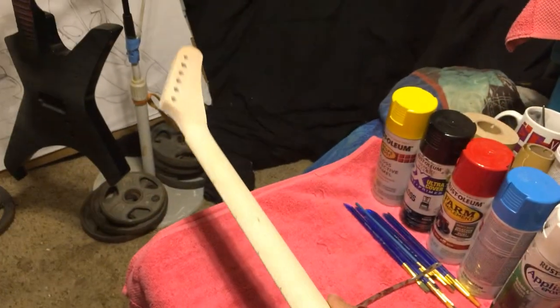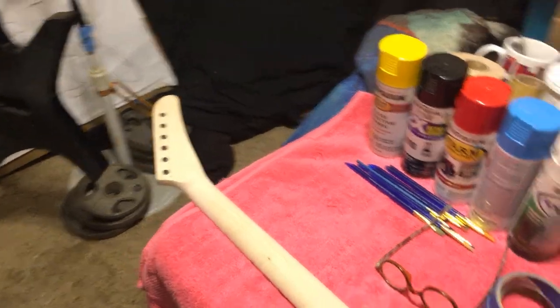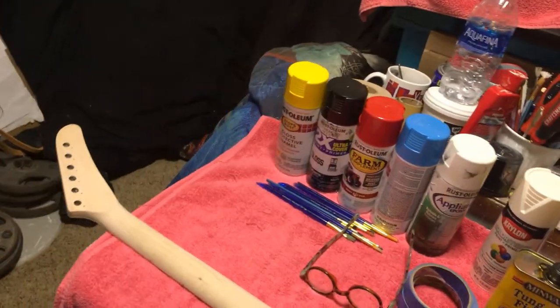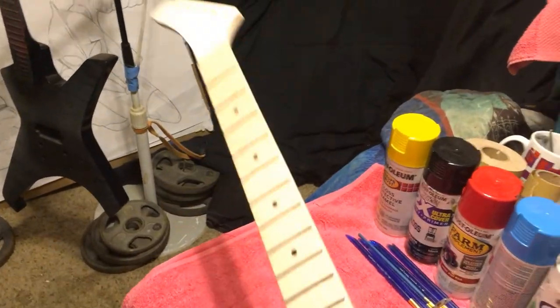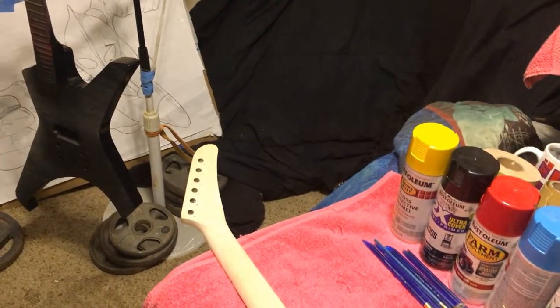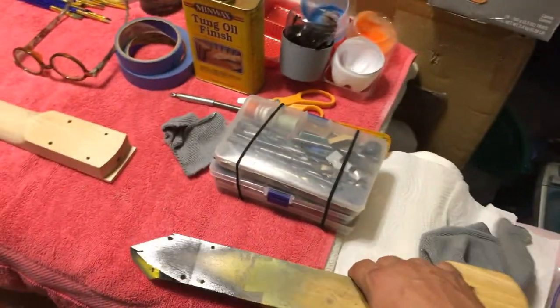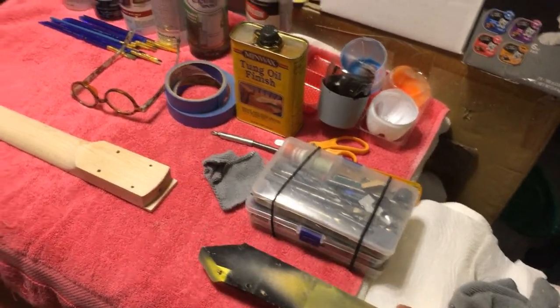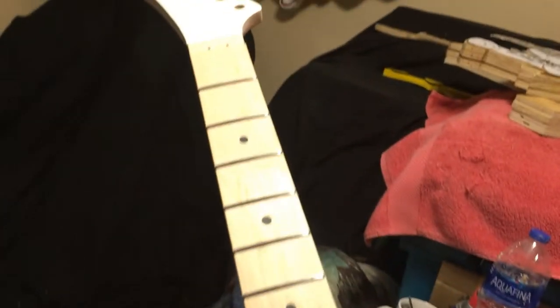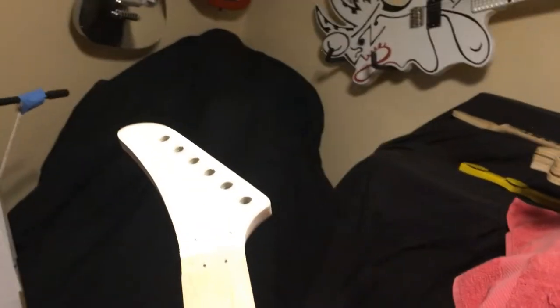So I'm going to apply several layers of tung oil just to condition and seal the neck. It might give it a little bit of color, which is fine on this neck. But yeah, I think I'm going to do that. I'm going to put it on the hanger. I got my hanger here specifically for necks. Then I'm going to let it dry there and then put several coats. I'm not going to put thick enough coats to where it drips on the front of the headstock. So I'm going to be very careful not to get any on the front,